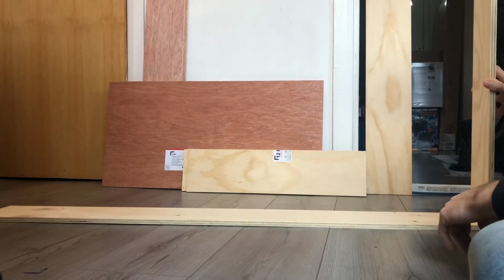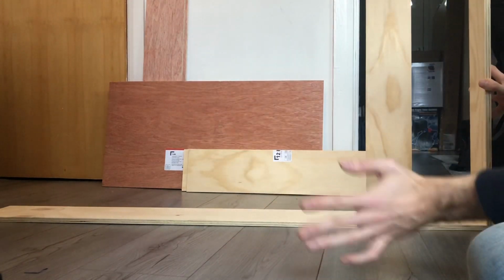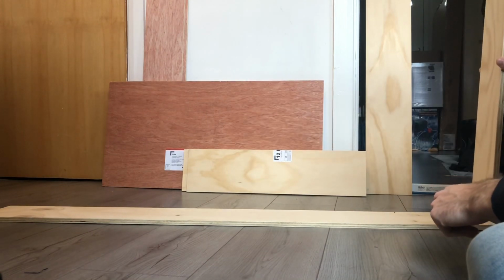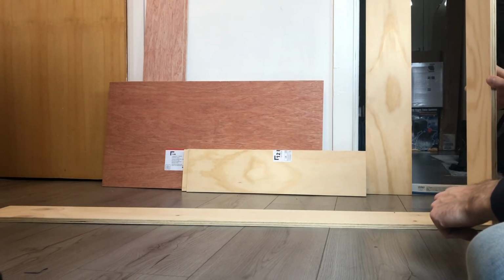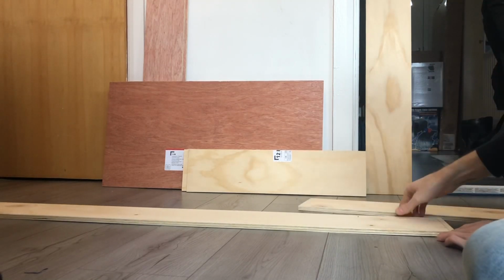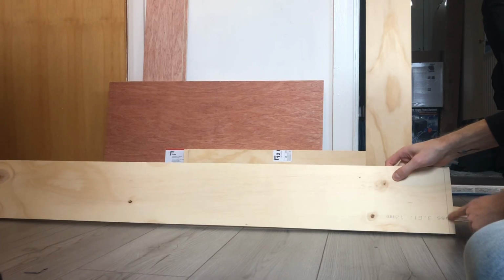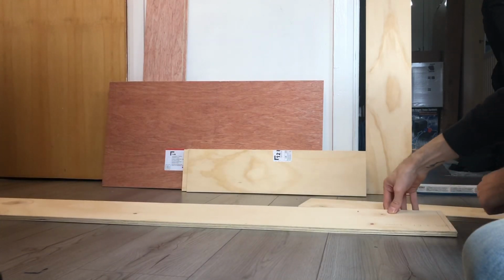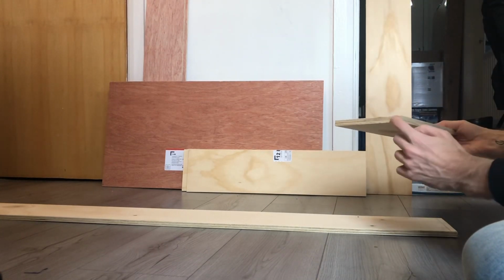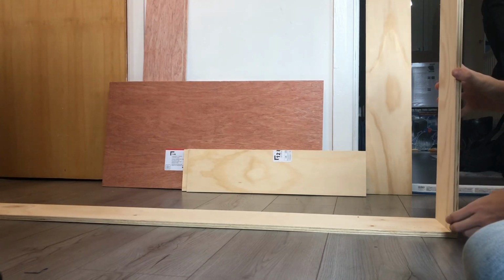So effectively it will be a box with 2 vertical supports, and the top board goes on top of that. And all I'm doing is just marking out the edges here. I run a line down, which is 12mm, and then I'll mark 3 screw holes, and then again screw holes in here that will get glued.